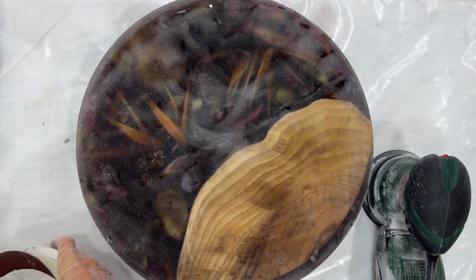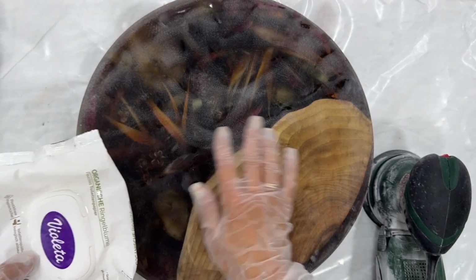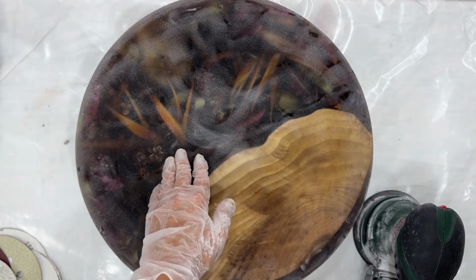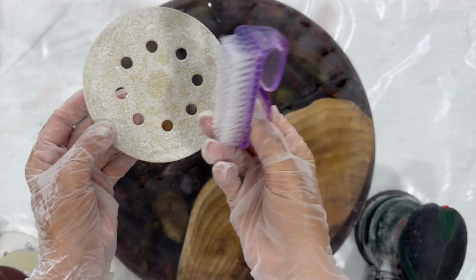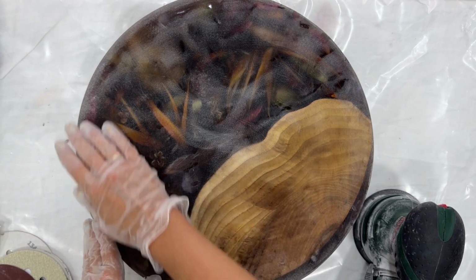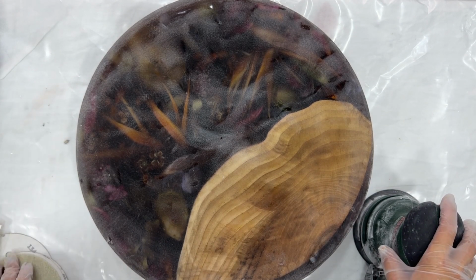Here is my collection. You should have napkins, wet or dry with acetone, with solvent, any. The main thing is that they clean well. You must have a machine, of course, and a brush with which I clean the disc after sanding. We also need to sand and clean the disc before moving on to further sanding. If you see that the disc is clogging, stop, clean everything off cleanly, and continue sanding.